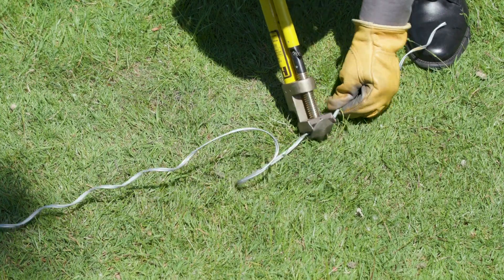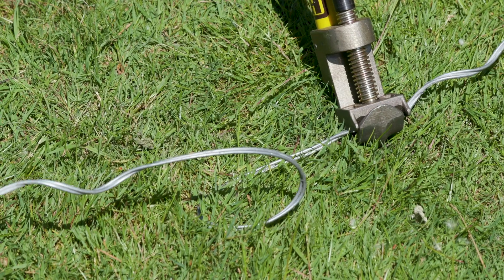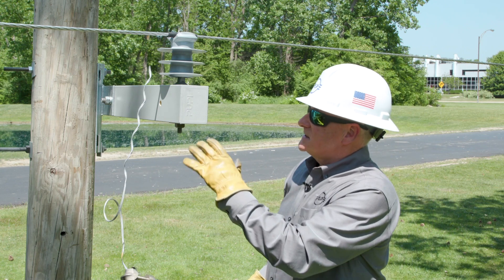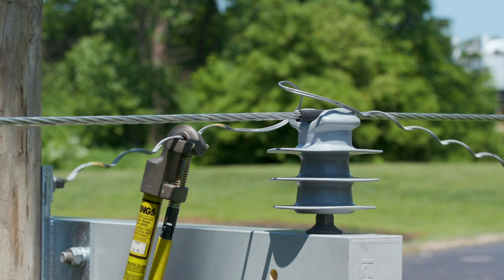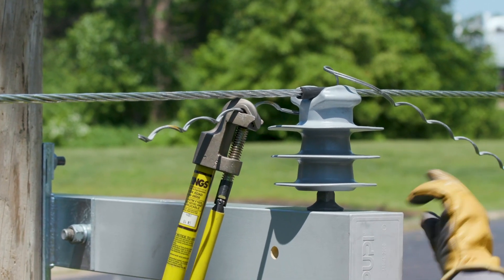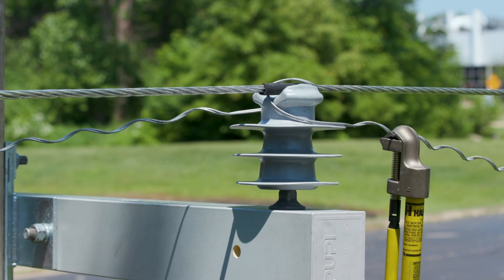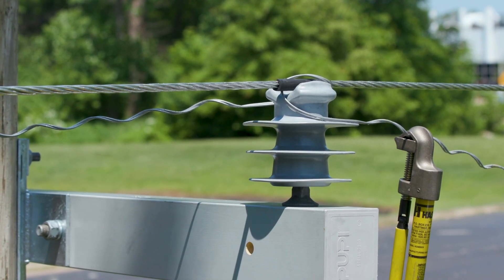You want to make sure your orientation is just such that when you lift up your stick, this opening will be on top of your insulator, and as you rotate it, it will lock onto the top. In this instance, on the outside of this cross arm, I'll go up behind it, lay it on it — I'll need to make sure that my leg goes underneath the conductor on this side and underneath on this side. I'll rotate it, it'll lock on your insulator, and now your pole buddy can come in with his applicator ring tool and install the first leg.